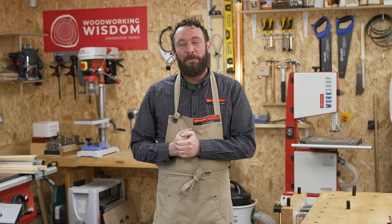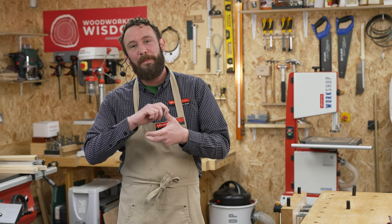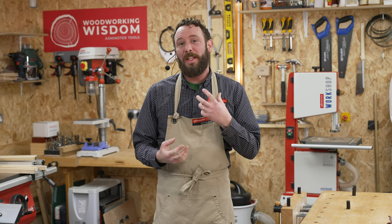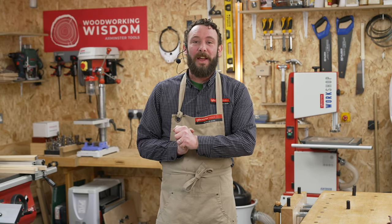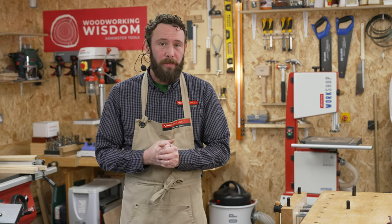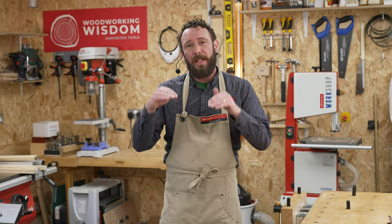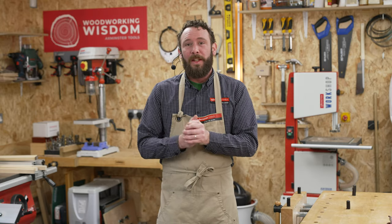Today we are having a go at a little bit of decorative carving. We've got a bowl, a little panel, and a project I did a few weeks ago, a croaking frog. We're going to scorch those using a burner, a blowtorch I should say, and also you could use black ebonising spray, and we're going to show you that as well. You could use any type of spray paint to cover the surface, and then we're going to carve beneath the surface to reveal the naked wood and give us that contrast. Let's go outside and prep our bits of wood.